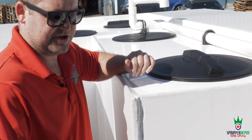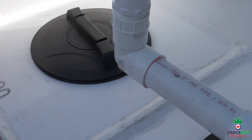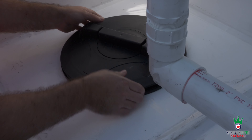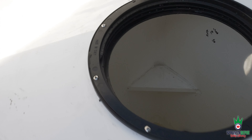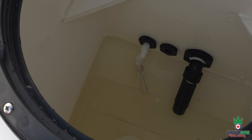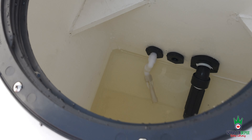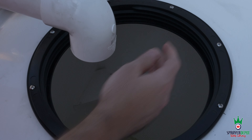Back up top — hard to see from the ground. Here's your 200 gallon tanks: your 100 and your 90. For simplicity, they just labeled both 100. You can open up the lids — two separate tanks. Looking inside, you'll see your suction fitting to pull from the bottom and your agitation jet as well, which mixes up the tank. The 90 has the same agitation setup, and it's going to be fed from the pump on the driver's side, which we haven't shown you yet.